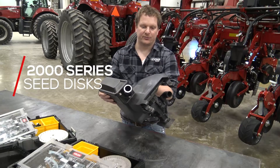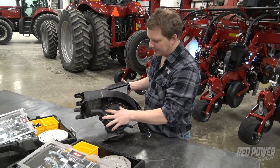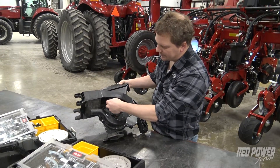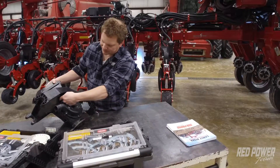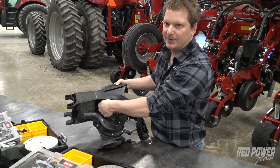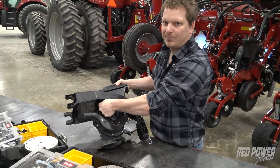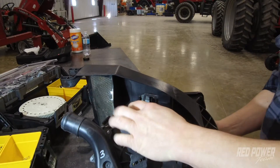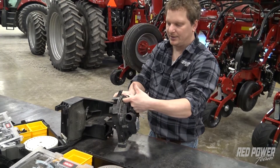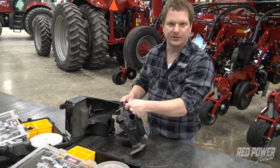The first thing we want to do is after we've removed that meter off of the planter, we need to take the meter off of the housing. In order to do that, what works out best is if you take your index finger and reach inside here and use your thumb. There's a metal clip in there, and if you push up on that metal clip and pull out, you pop that meter right off of the housing. That works pretty slick by using your index finger and your thumb to push up on this metal clip in order to remove that.